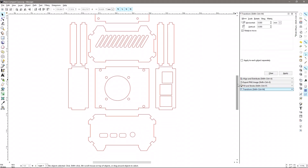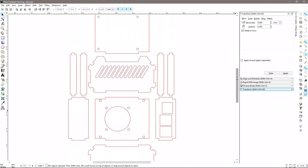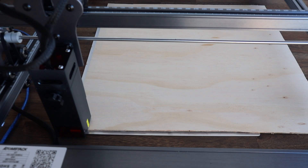Once I was happy with the quality of the cuts I moved on to designing the case. I've been wanting to create a more compact or low profile version of the 3D printed case I made previously, and if I make it from plywood then it could easily be assembled and painted any colour to suit the project. I came up with this design drawn up in Inkscape — it has a similar form factor to my other cases but with a fan on top that blows down onto the processor and exhausts air out of the vents on the side. I then put a fresh sheet of plywood into the bed of the X7 40W and got cutting.